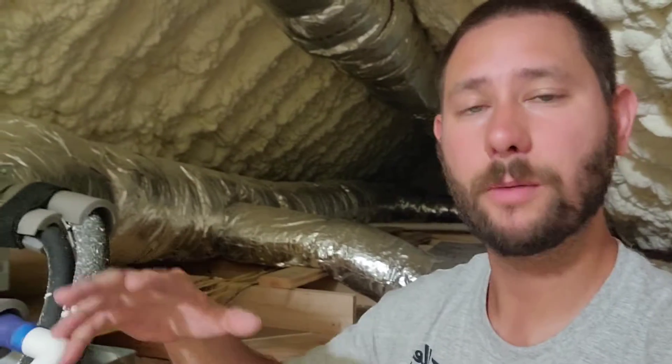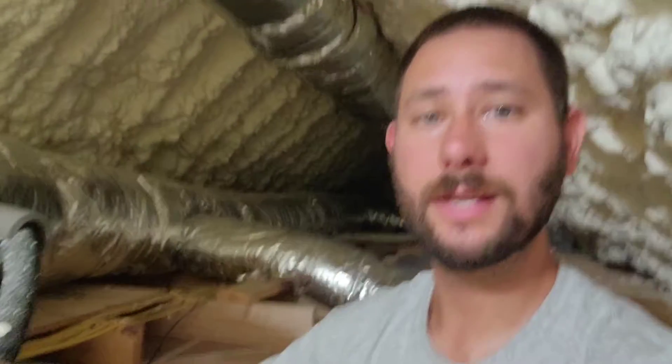One thing I want to say about foam is the reason we install Samsung in foam houses is because they have the capability of modulating their variable capacity. It's better for a foam house because it doesn't take as much cooling and you're able to start up very slowly and softly. During the heat of the day, as you need more power, this system is able to ramp up its capacity instead of wasting large amounts of electricity. It's able to modulate — it's kind of like cruise control. When you need more, cruise control will ramp up a little bit.